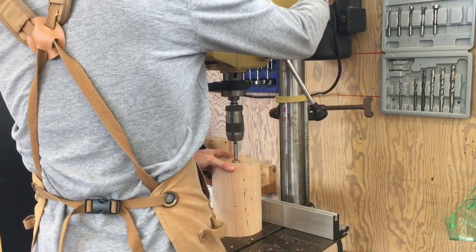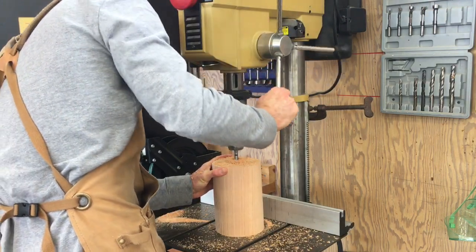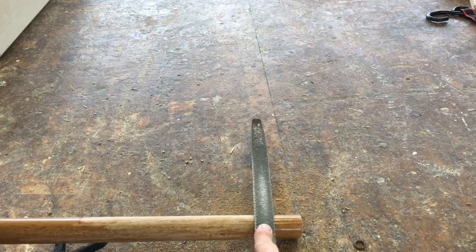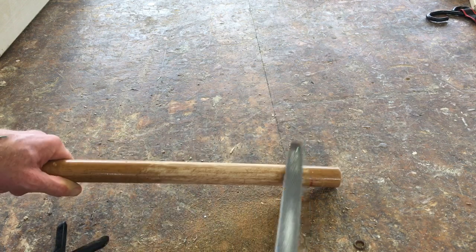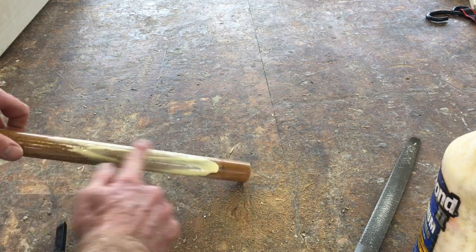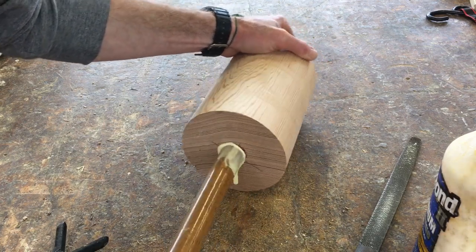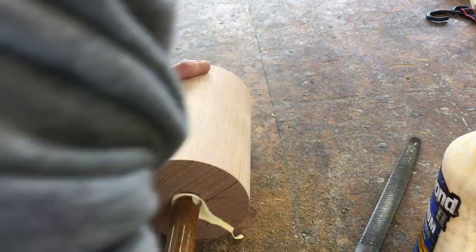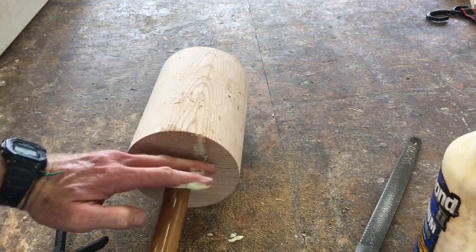Because our dowel was so tall, I had to drill from both sides of the ends. Once I had a hole drilled, I roughed up our dowel using a rasp. You can see there's a finish on it left over from when it was a broomstick. I added glue onto the roughed-up surface and then put the dowel into our new dowel. I made sure to wipe off all the extra glue so it wouldn't get in the way of our turning mechanism.